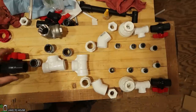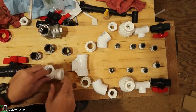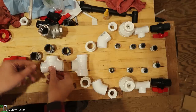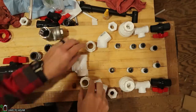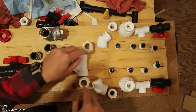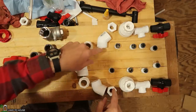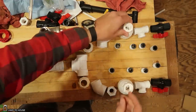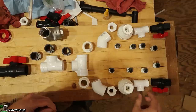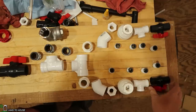Here's how I built this thing. I've got a one-inch ball valve with a couple of one-inch nipples to a threaded T, which goes up to the check valve, comes over to another T, which then cuts off to these 45s into some reducers down to half inch, and these half-inch spring valves, some more half-inch T's, and then over to the ball valves at the end.